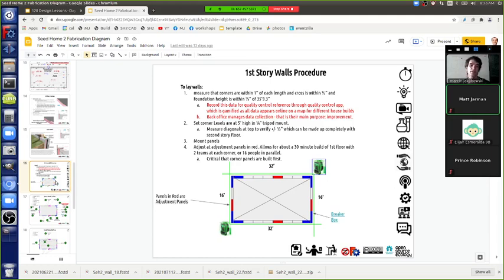When you put the panel up, take a piece of white paper and hold it next to the wall - in daylight the green laser is marginally visible, but you'll see the laser dot, actually a line. If you're about half an inch away, you're good, so you can gauge the vertical alignment of the wall.